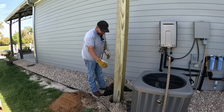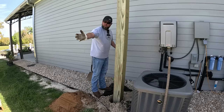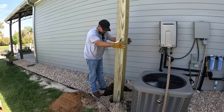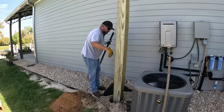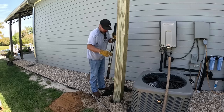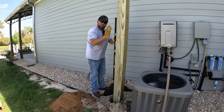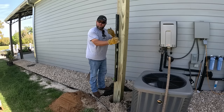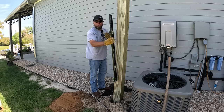What I'm going to do now is pull this post to that string since that's my reference string — it's a nice straight line because I want this fence to be perfectly straight. I'm going to take my level and work my post around in the hole. As soon as I touch the string, I want the post to be nice and plumb — straight up and down both ways — so we get that perfectly straight fence.